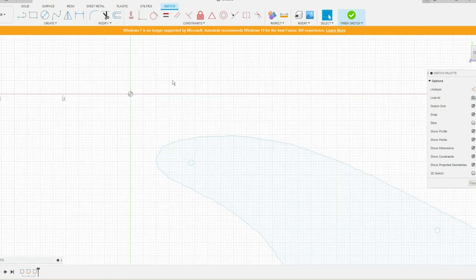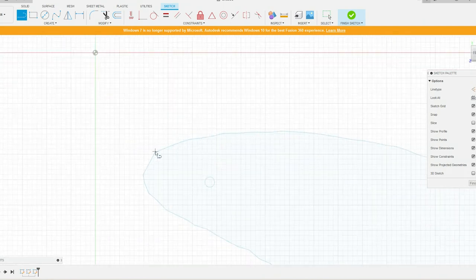What we're going to do is zoom in, and I find it best to use the line tool because we have the ability to make curves and things. So we're going to pick a start point here, and you may want to project a point. Actually, maybe I'll just show doing that. So if we do project include, we can pick a point, and that can be our start point. So first we're going to just select that point, and we're going to make a very small line.